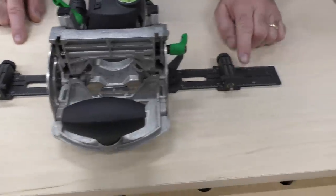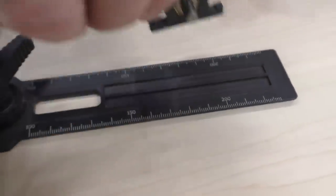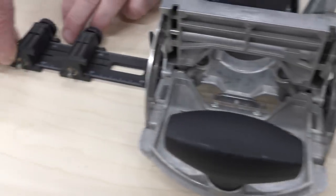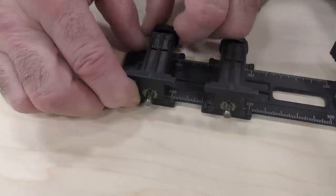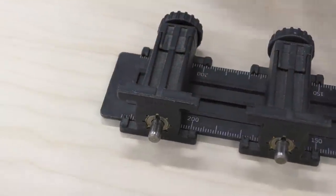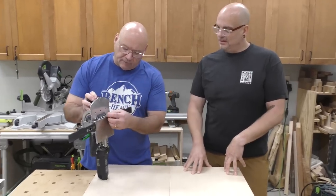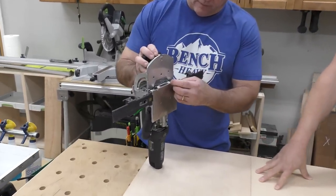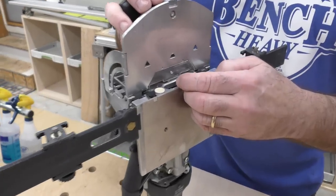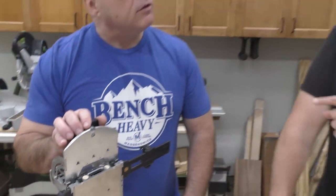You may ask: what is this outside cursor for? Remember I said you always read the inside. What if I want to set up an extra set over here, or pick up an extra set because I have multiples, and I want to space them six inches and eight inches apart? These are all spring loaded. So instead of these flaps — from here to the center of the bit is 37 millimeters.